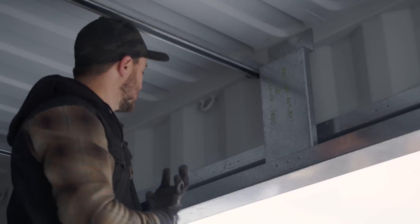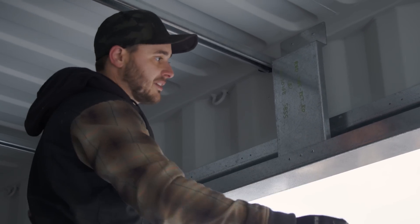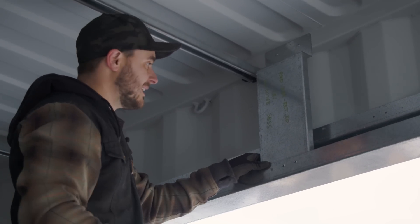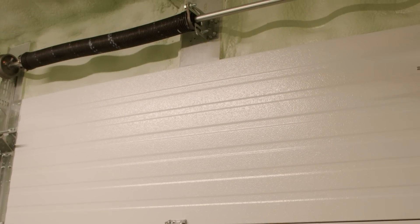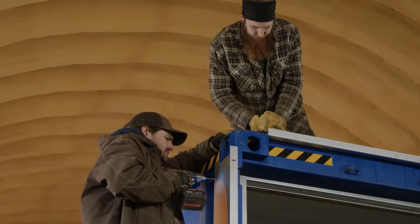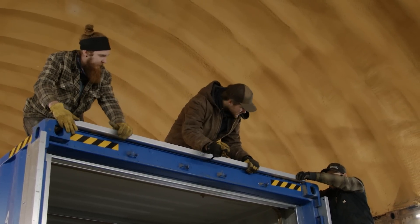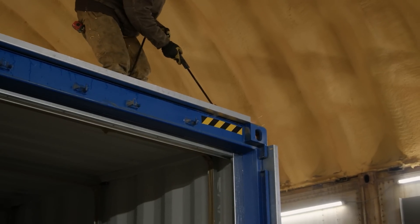This header is a hollow section, so the spray foam contractor will be able to get all the foam in there. The side frames, the lip of the header, and the center frame are all on relatively the same plane, which will allow installation of all the slotted brackets and tracks for this overhead door. Before spray foam, we installed interior wall flashings and exterior flashings. Given this is the first time we've installed this kit, some minor adjustments had to be made, which have been corrected in our 3D model. All in all, the process went quite smoothly.